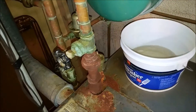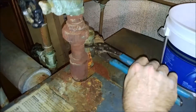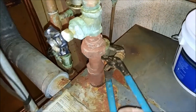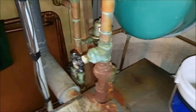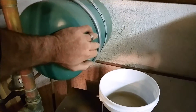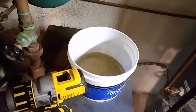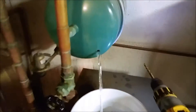I'm going to pop this auto vent off there to get this thing to drain. She's good on there — she don't want to come off. The tank's kind of flooded. It's warm as can be and it's still draining. I don't want to be here all day so I'm going to have to drill it. Let me drill the tank here real quick and just drain it in the bucket so I don't have a ton of weight on this thing. There we go — one way to get the water out of there.